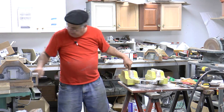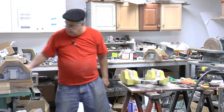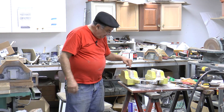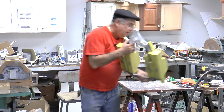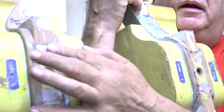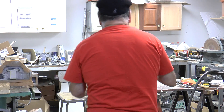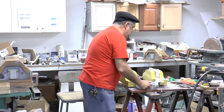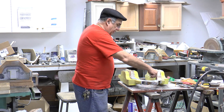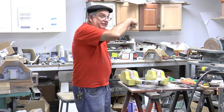Now I want to mention — there's threaded holes, and I'll show them to you. Right here, here, here, right there, and one there. They're threaded for 5/16-18, and I've got to make a bar or something up here like this — a handle, and then one over here — and they wrap that thing, and then they have a way to pick that pattern up out of the cope.